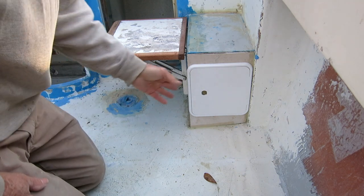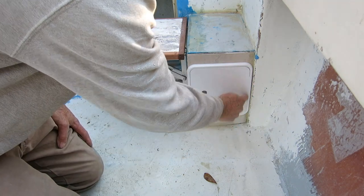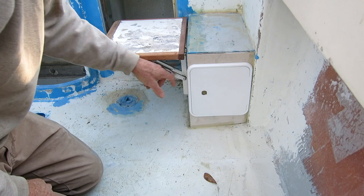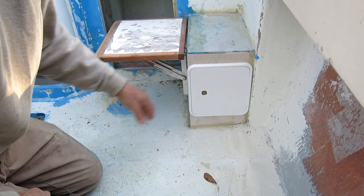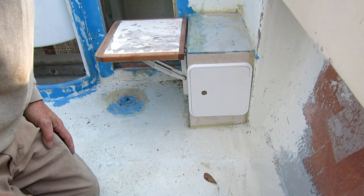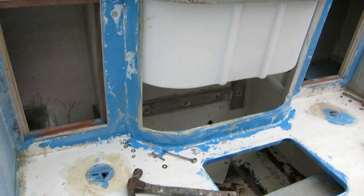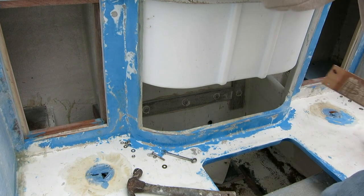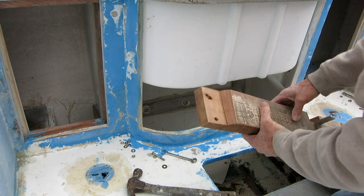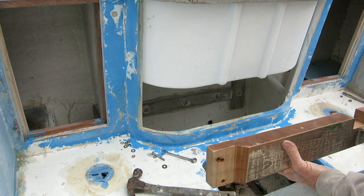The little hatch doors are in place. It's very close here — if I round this corner too much it won't work, so I might have to file a little bit off the side. I'll be careful when I sand this corner not to round it too much. I didn't show it but I did move the battery out of the bilge — put it way back in the corner where you can barely see it. What's left now is just hours and hours of sanding and fairing, and I'm not going to subject you to that. The next time we show this back area, hopefully I'll be putting some primer paint on it. Thanks for watching.